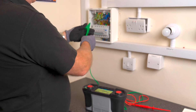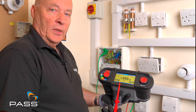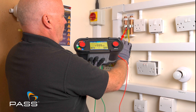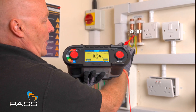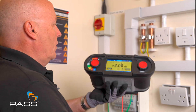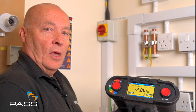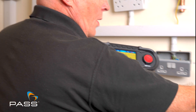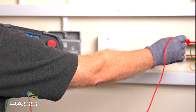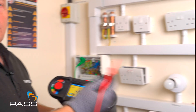If I put my clip onto the earth bar — we have an auto-start feature on this which means I don't need to press my test buttons with the X1, I just need to make a contact. So I can go onto this connection here and you can see a value. I'll just turn the noise on so you'll hear it better. That's connected to earth. I'm going to pan over here now, and this copper pipe here also. I'm getting a reading — there we go, just the contact. So now we know that all the bonding is connected here.